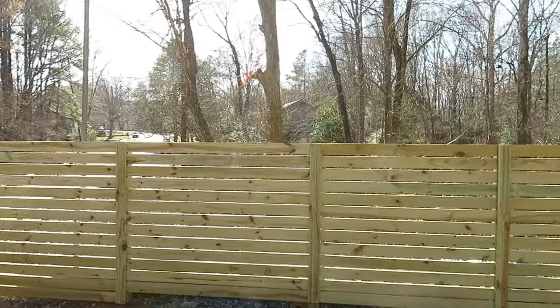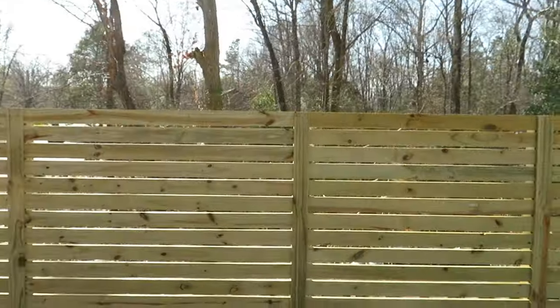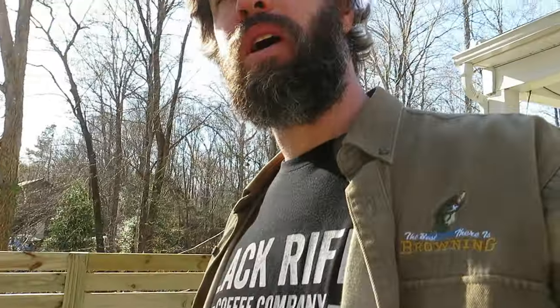If anyone who's watching this video saw the covered deck build video that we did a couple years ago, this is the same lattice work style that we do underneath all of our decks. That one, I think we alternated 1x4s and 1x6s, but we spaced it 3/4 inch. And here we opted for going 1/2 inch, just to decrease it a little bit. And it works proportionally. I think it works really well. So, all right, time to do caps.